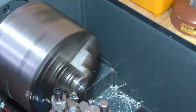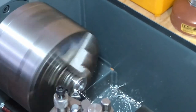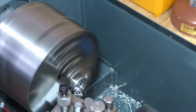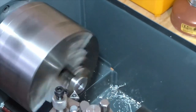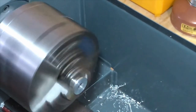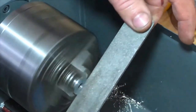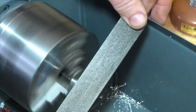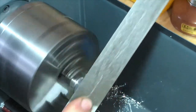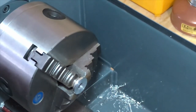On my other lathes I don't have too much of an issue with that. You can end up breaking stuff in the lathe really easily when messing with parting tools. I'll just give that a little chamfer with the file — and that is one bushing complete.